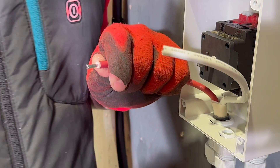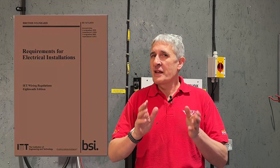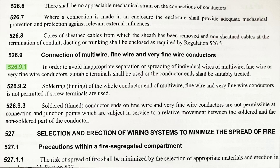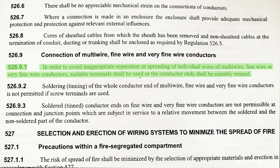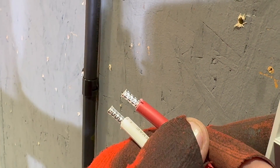In terms of terminating cables, solar cables contain class 5 or stranded conductors, so they deserve special treatment. This is also a regulation within BS 7671. Turning to regulation 526.9.1: in order to avoid inappropriate separation of individual wires of multi-wire, fine wire, or very fine wire conductors, suitable terminals shall be used or the conductor ends shall be suitably treated. The IET does not provide a specific definition for 'suitably treated', but in our perspective this entails adding a ferrule at the end of the wire. Since solar cable has double insulation, an oversized ferrule would be necessary, but it's better to use a bare ferrule without the plastic sleeve so that the copper tube matches exactly the cross-sectional area of the conductor.